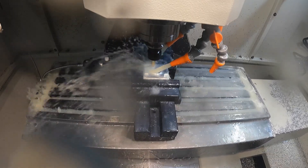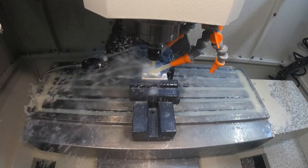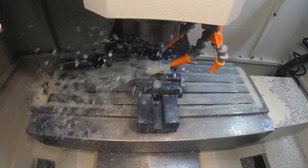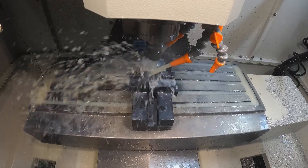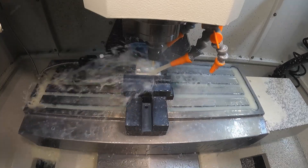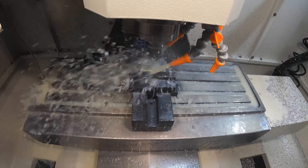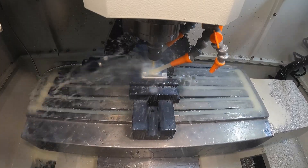You're going to see some coolant splashing on the camera. I've got the coolant pump really turned down — the coolant pump on the Syil is pretty amazing. There's a ball valve to choose between the wash-down hose or the coolant lines, and I can vary the level to control how much comes out. For this video it's way turned down. A lot of other machine users are trying to find better aftermarket pumps, but on this machine my biggest fight for videos is turning the coolant down. For production runs you can really get good coolant on the part and blow those chips off.